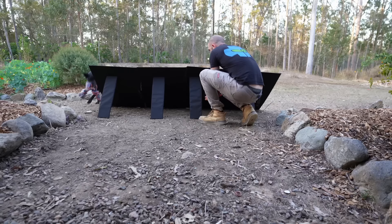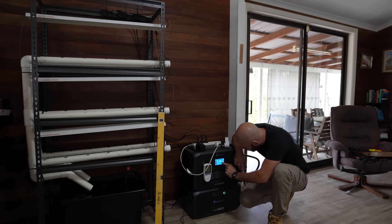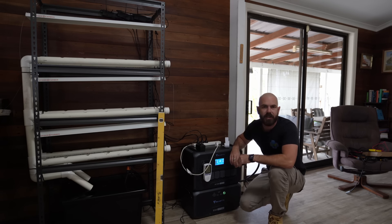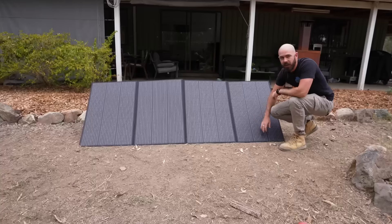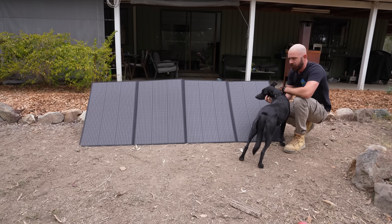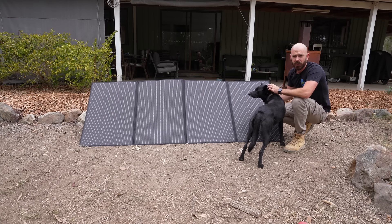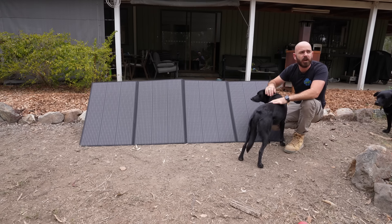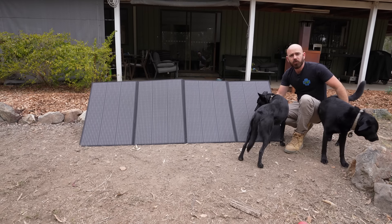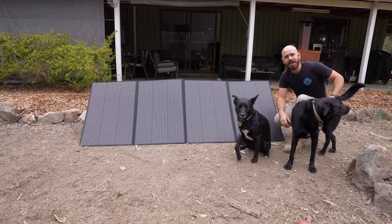That's a big array. This is definitely going to be a learning curve for me because I'm not an electrician. I've set up the photovoltaics — the solar panels — and we are getting 62 watts. It's a cloudy day outside. These are really nice panels, but I am interested to see if they put out 350 watts once we have full sun. If not, the system actually allows multiple solar arrays to be connected up. What I'm trying to do is run it in surplus during the day, with the lights on during the day as well, so they will be drawing from the solar. I'll probably run the lights for about 12 hours, and hopefully get eight hours of sun per day.